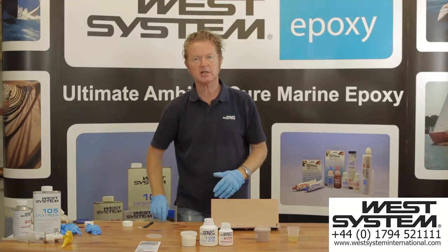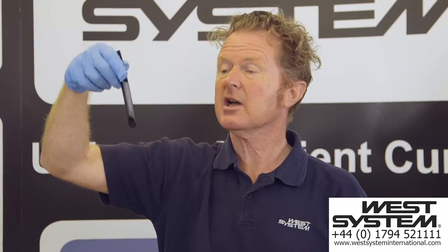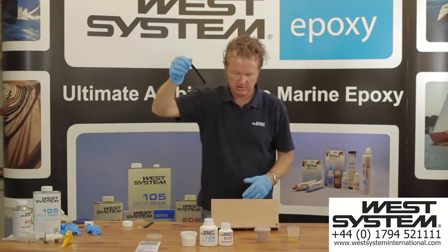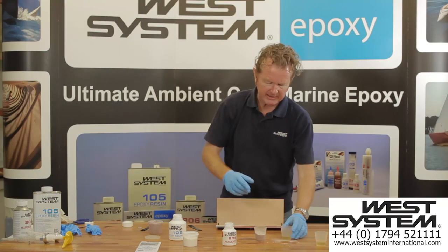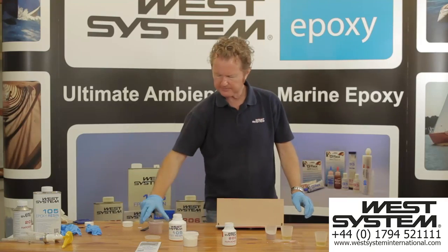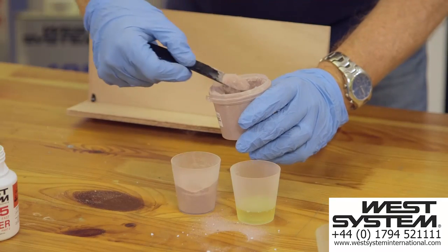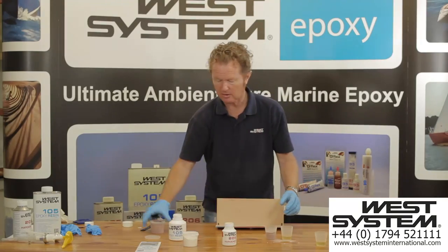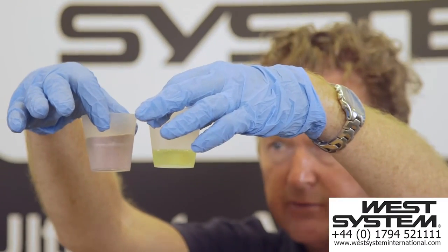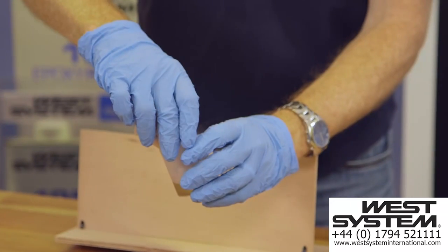In fact, it will stay on your mixing stick upside down, and that's a very good test of how thick it wants to be. That's how you test for the correct viscosity. We need to add our filler to get us to our peanut butter consistency, and we do that by adding a little bit more than twice the volume of filler to the mixed epoxy. And you can see here that I have roughly twice the volume. Tip that straight in.